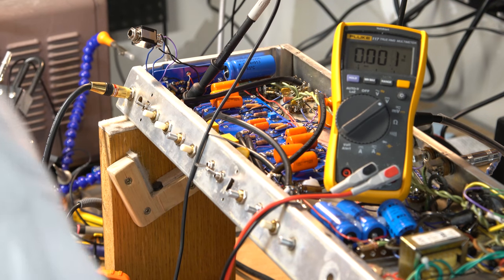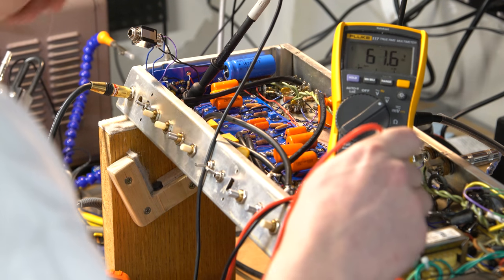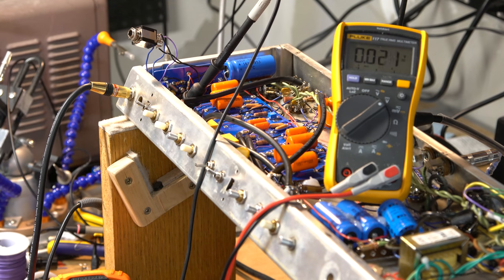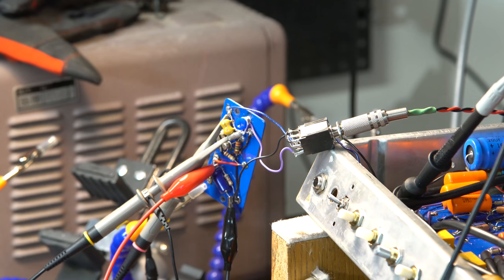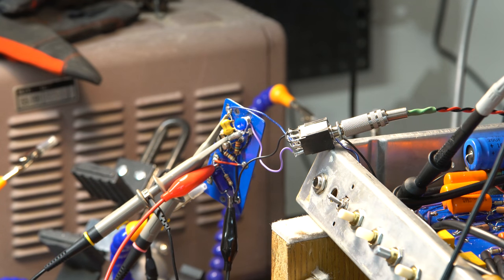I'll make sure the caps have drained all their power out. We'll come back in a second — I'm going to have this board pulled up and out and zoomed in a little bit more so you can see me troubleshooting. So I've got it set to 8.1 volts because that's what we were getting, and I'm connecting it into that point. What I'm going to do now is try and see if I can get some checks of whether the signal is getting through.